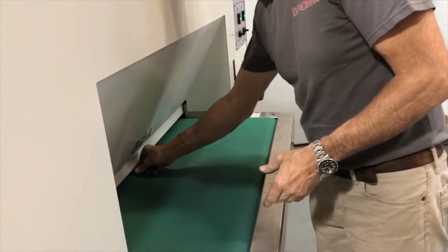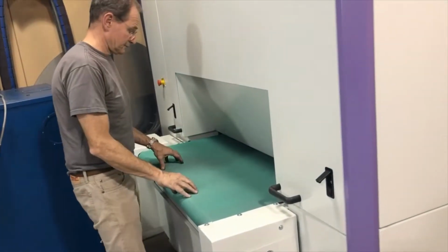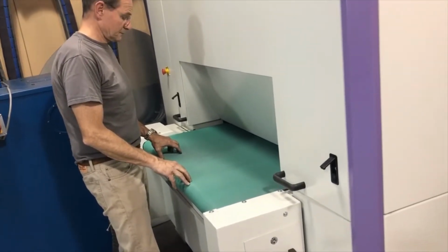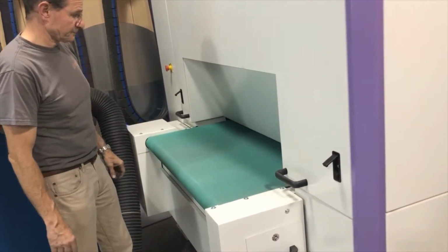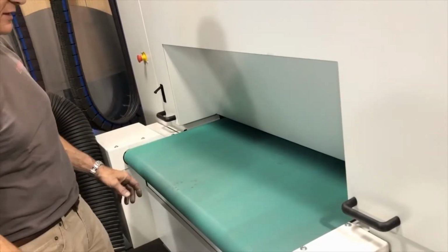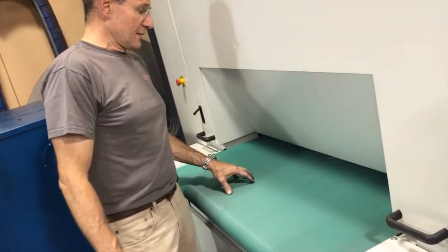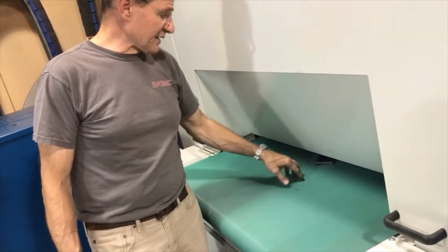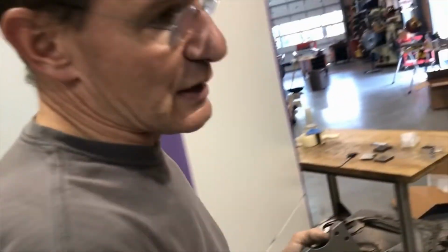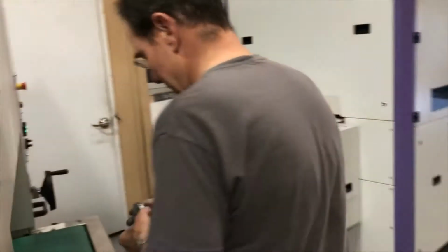Here's the other side now. Okay. And now we need to do the same exercise from this side. You're running about 2.5 feet a minute with wire brushes, especially if you don't have the wire speed that you normally should have. You're going to be at a very slow feed rate. And even in thicker materials like this half-inch, even on double-sided machines where you really can go into it, typical feed rates are 36 inches and below, all the way down to 18 inches a minute to get it good.